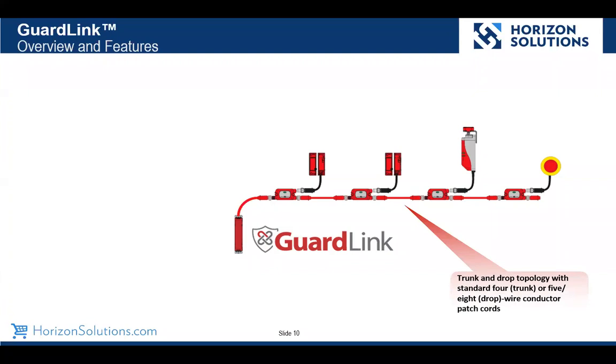Well, it's a trunk line, drop line technology. The trunk line is a standard 4-wire trunk, so GuardLink is a 4-wire network, and the drop lines are either 5 or 8-wire conductors. We use standard safety input devices. In this case, we've got a standard e-stop or a standard guard door lock, and we support either electromechanical switching devices or solid state switching devices.